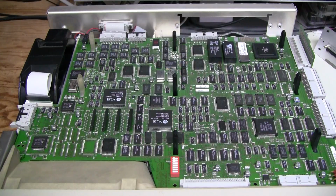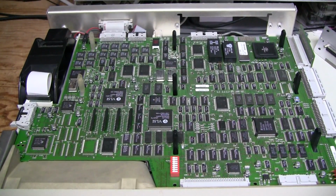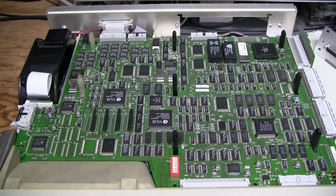And then it occurred to me to run the signal path compensation, and the gaps in waveforms disappeared. So it seems to me that those gaps were the result of running the signal path compensation before, when the triggering was not working properly. So the lesson from this is, if you fix something on the acquisition board, run the signal path compensation before doing anything else.